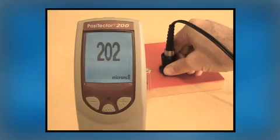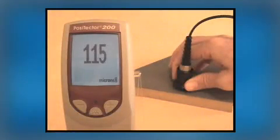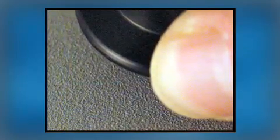The small variations in individual thickness results are due to substrate roughness. The effects of coating roughness are more dramatic, as illustrated here by a low result. Rough or textured surfaces cause the instrument to occasionally display low measurement values, typically under 50 microns (2 mils), depending upon the amount of roughness.